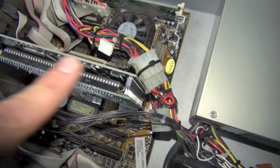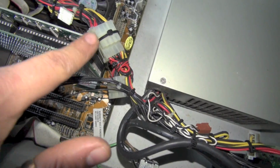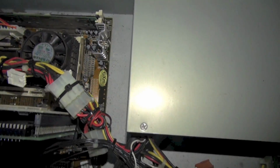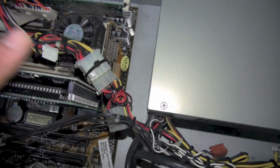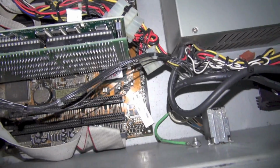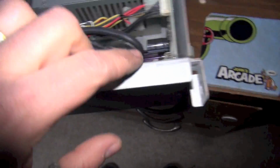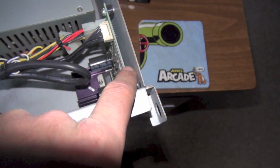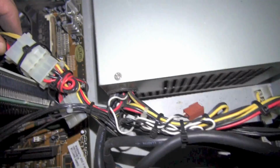This is the Prism card here. What's interesting is that all the data for the game actually lives on this. There's no hard drive in this. We basically have a RAM, a CPU, and a fan, and then this, what they call the Prism card, and this is what makes this hardware special and not just a PC. It's this custom hardware right here. And then over here's our power supply. I don't know, this might be a sound amplifier right here. So I need to tap into here somewhere and get 5 volts.